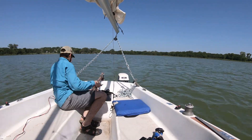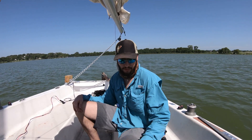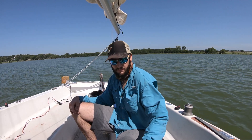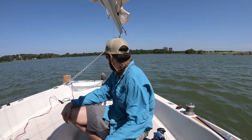The actuator is installed. We're still only doing three miles an hour here. I'm going to enable my steering — and here's a starboard turn. Alright, start straightening back out. Looks like it wants a little bit of starboard rudder. At three miles an hour the boat seems to be doing fine. This is just me manually — the actuator seems fine. I'm going to crank the speed up a little bit to around five miles an hour and see what it does.